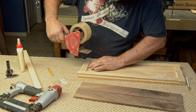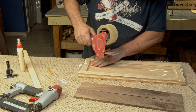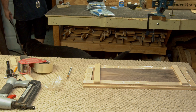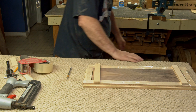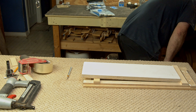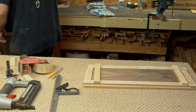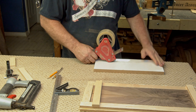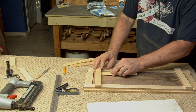To keep the epoxy and fretboards from sticking to my jig, I lined everything with packing tape. Both fretboards have a slight bow in them, so I made little crossbars to put some wedges down and wedge them flat to the frame to take that bow out. I didn't want the bag to get stuck to the epoxy, so I made a little centerpiece to cover that area. I used melamine so the epoxy really shouldn't stick, but I went ahead and wrapped the melamine in packing tape anyway. Then I made some wedges to hold down the ends of the fretboards.